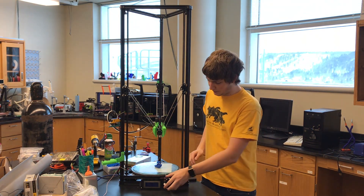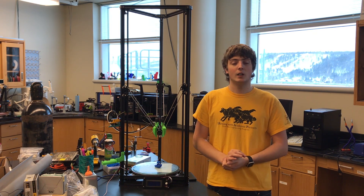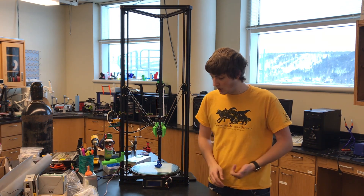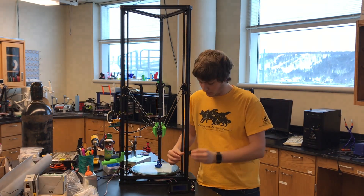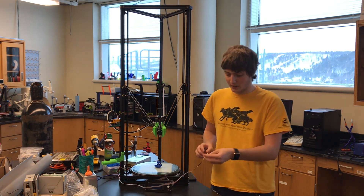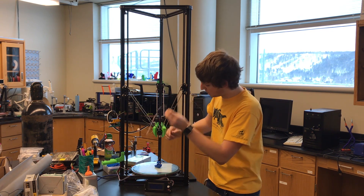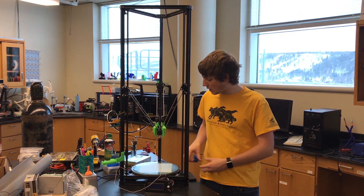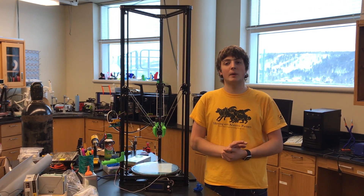Another upgrade I'm going to try in the near future is replacing the LCD with a TFT 3.2-inch touch screen, which will be super nice. Currently I've just been printing everything with the SD card that came with it, so you don't need to have it connected to your computer. Something I forgot to mention is it does have auto bed leveling — you just attach the foam probe to the bottom of the nozzle, click auto leveling within Marlin, and it'll go around and probe to figure out your bed leveling.